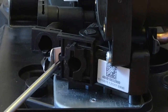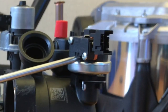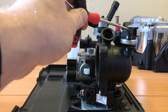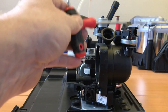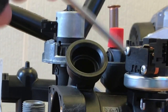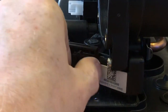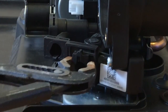The things we've got here: down the bottom is our central heating filter. Then we've got our low water pressure sensor - it goes off at 0.4 bar and comes back on at 0.6. If it actually makes a circuit it fails to safe - it sends power to it all the time, and if it sends power back to the board it knows there's no water. This is also the automatic air vent at the back, and we're going to take that out as well. Let's take the filter out first - just pull the pin out and then pull it towards us.